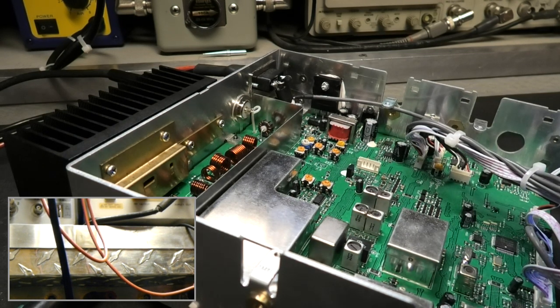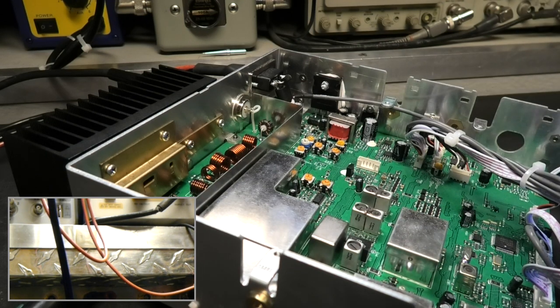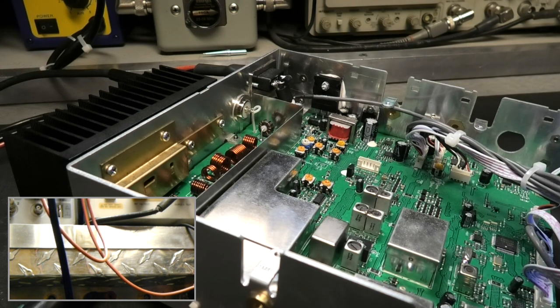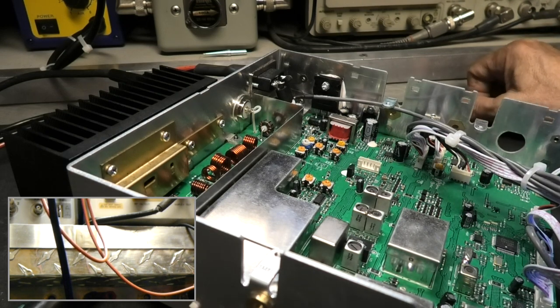But it's gonna show distortion at the outer limits when I double scale it. So let's just consider double scaling normal, like one bar up, one bar down. Remember, we're going to be comparing two bars up, two bars down as one. That will be equal. Then we're going to go back to the regular 400 megahertz, and I'm going to show you the difference. This has to do with the vertical amplifiers. In this one, it's just attenuating everything over 20 or 30 megahertz. So you're gonna see it.